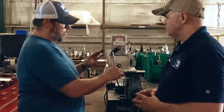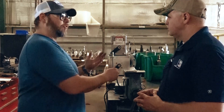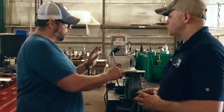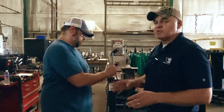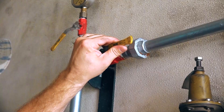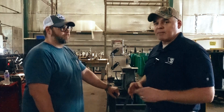Instead of trying to get the valve in a sweet spot, we just disconnect the linkage and get the valve to a 45-degree angle — and we're good. Freeze protection is a huge deal here at Power Mechanical. In fact, last week's boiler room tip was on freeze protection for your valves in dry layup, so if you haven't seen that video, be sure to go check that one out as well.